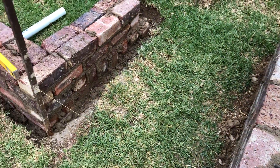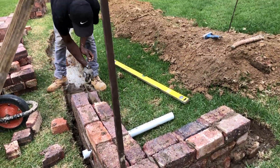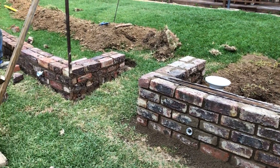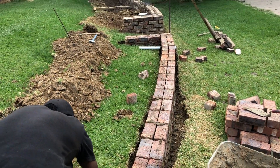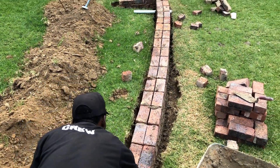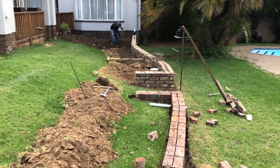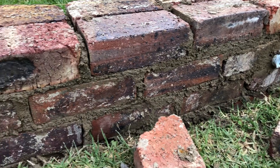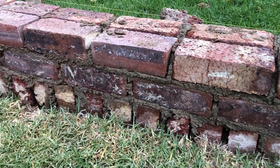We wrapped up part one by finishing the first half of the retaining wall and now we're moving on to the second one. That gap in the middle will be the paver patio pathway, and that'll go up in the center — we'll show you that a bit later on. Now we're cracking away with this side. Here's a nice view of the overall shape of the retaining wall creating almost a half-circle, organic shape as the homeowner outlined it on the lawn. Here's a view of the brickwork going down as well as that roller course at the bottom, which creates a level surface for us to start building up on.